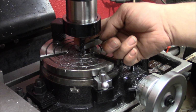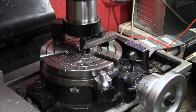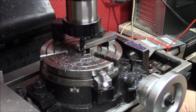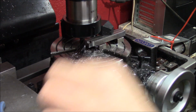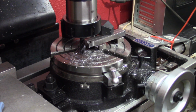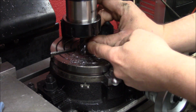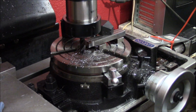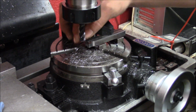Now I will just take a hair off the front edge to make a perfect fit. I'll just touch it off and then take 1/10 of a millimeter or something. That's 4/1000 of an inch. And that's not very clever. I found it. And let's see, we can take this out of the fit. Actually that looks very nice now.